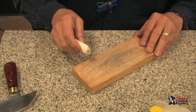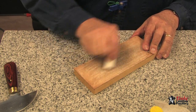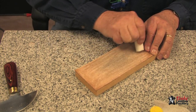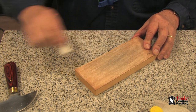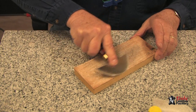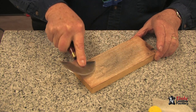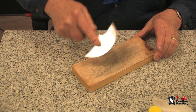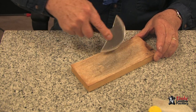After you have sharpened your knife, you need to keep it stropped. I've made a strop here with just a piece of thin leather cemented onto a piece of one-by-four wood, and I'll rub this with jeweler's rouge. When stropping the knife, I'm pulling it away from the cutting edge and making sure I cover the entire blade. You should do this every time you pick up the knife and every so often as you're using it, to make sure that it cuts nice and smooth.